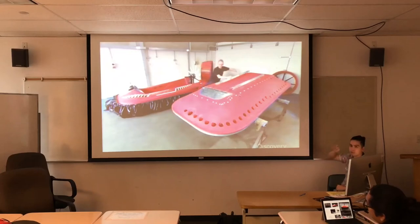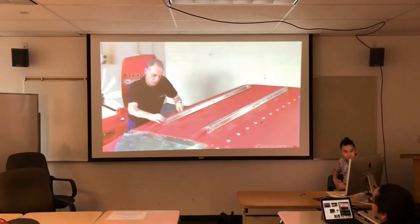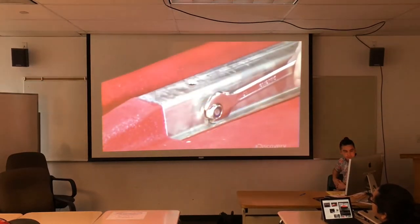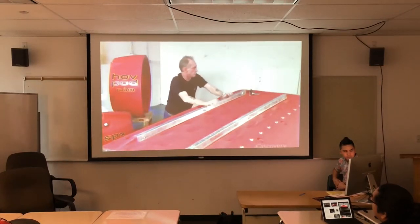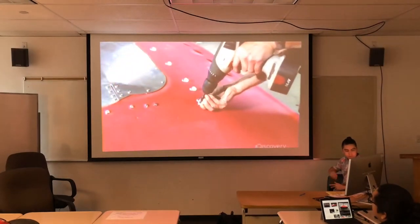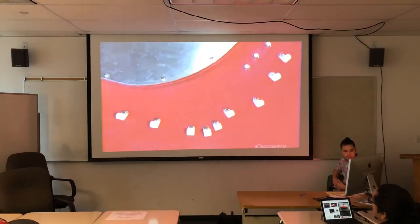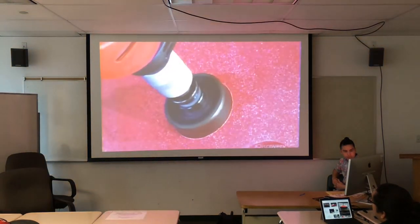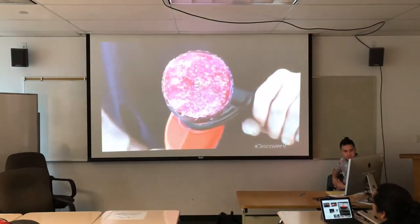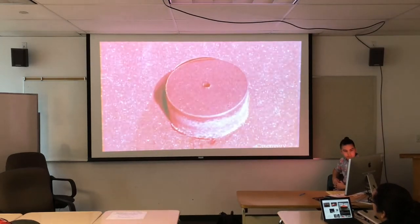Production begins with a hull made of lightweight polyethylene. The fabricator installs aluminum skids on the bottom to protect the hull during landings on rough surfaces. He screws plastic attachments for the hovercraft skirt into pre-marked positions on the hull. The technician then drills 65 holes around the hull — the fan's air will pass through these holes to fill the hovercraft skirt.